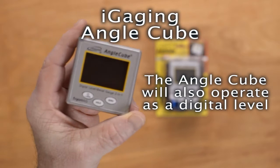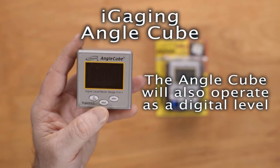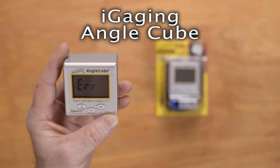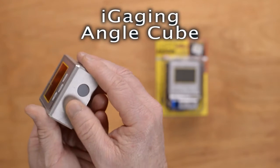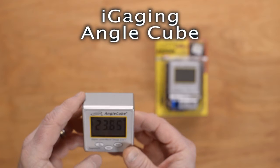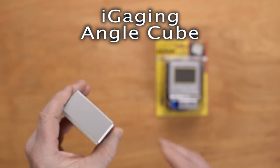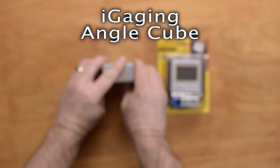The way the product works, it's very simple to use. I do have an instruction book that's quite clear, but in its basic form it's got an on/off switch. What you do is you zero it out on a reference table, board, or metal piece — whatever you want to reference against. You lay it on there, and it does have magnets on two sides — on this side and on this side — so it'll stick to anything that holds magnets. You set it on the surface you want to zero out against and hit the zero button.